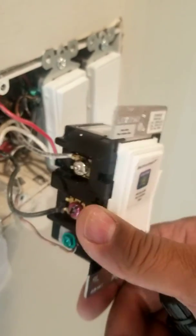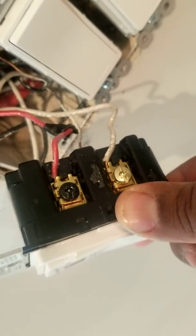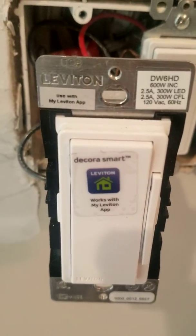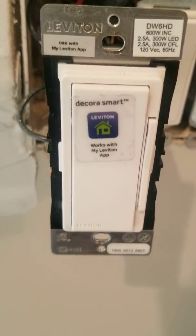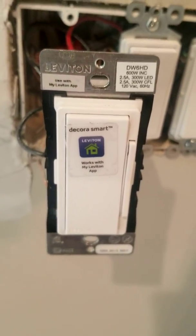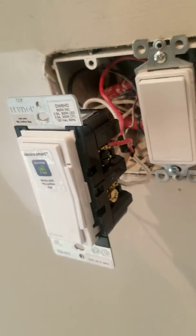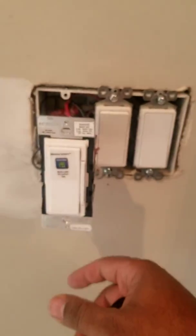The neutral and the first traveler wire stay the same on both boxes. The ground stays the same on both boxes. This model — the master switch — goes to the load, with a line for the light or fixture or whatever you're powering up. If not, it will not work. You will have a headache. I spent two days trying to figure this out, and finally tried the last thing somebody suggested and it works. The lights are consistent — I can dim and turn off the lights from both locations, and I do not need a hub.